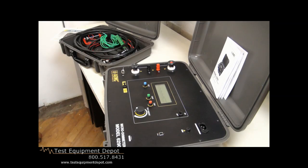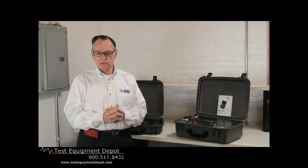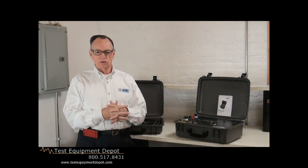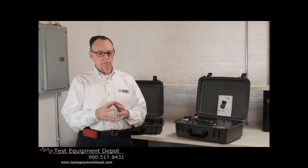What we have here is a device that can measure resistance down to 0.1 micro ohms, all the way up to 20 milli ohms, which gives us a broad spectrum of measurements. The resolution is unprecedented at 0.1 micro ohms. Accuracy, heretofore not available, is 0.5% of reading — not of scale, of reading — which is a significant difference.